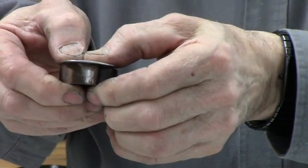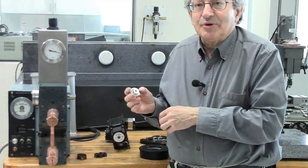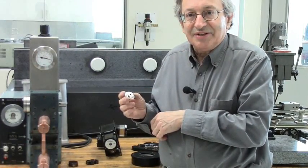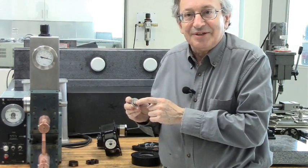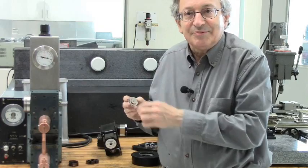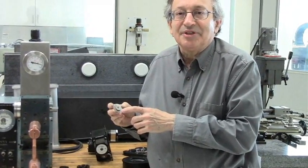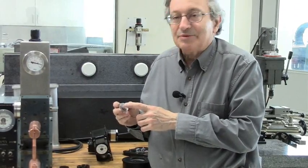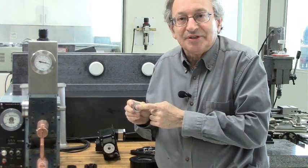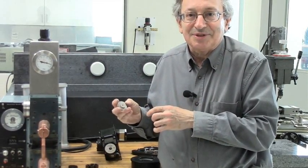The two nice things about these disc springs: first, they go completely flat when compressed — they compress to the thickness of the material, which means minimum clearance. Second, they don't have to be constant-K springs. If I cut a spiral with a constant width, the spring will not be constant K because the outer spiral deflects more easily than the inner spiral, making it progressive K. If I wanted constant K, I would linearly taper down the spiral. This means I can take any plot of force versus distance and convert it to a spring design — making an arbitrary K function, which is very convenient for springs needing a wide dynamic range.